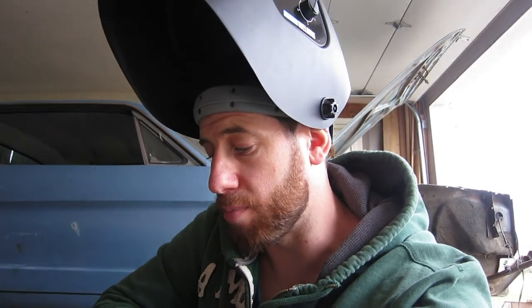This process was a little rushed — I would normally take my time between spot welds, spacing them out to prevent warping, but I wanted to get this filmed for you guys. I have a long ways to go but I'm building up confidence, and I feel like before long I'll be ready to try welding some sheet metal on the car. One thing I'll note: using acetone to clean the metal definitely seemed to help cut down on the soot.